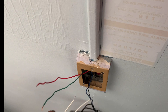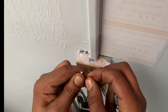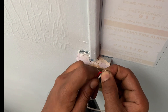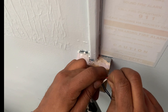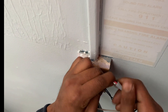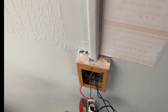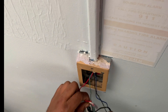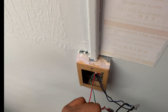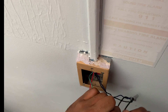Getting my red wire — my positive — connected to the white wire. I'm going to twist it to make an even connection for my marette so it connects properly, then tighten it nice and tight. Twist the marette clockwise. Then my other side of the white wire goes to the end-of-line — the green wire here is being used as the end-of-line — so connect it to the other side of the white wire. There you go, now it's all connected.